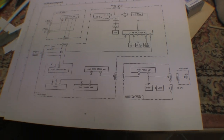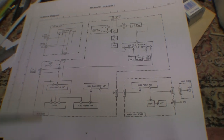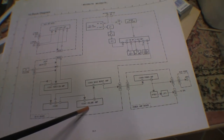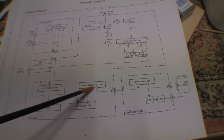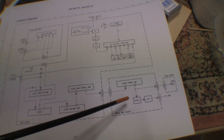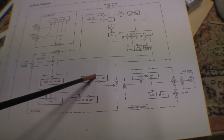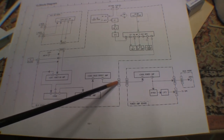Okay, a bit of a wrap-up on this stereo. I think it's fixed. Looking at the block diagram of the whole setup: since the problem is the volume suddenly jumping to 100 percent, I figured the fault has to be before the power amp — because if the signal didn't suddenly arrive at a high level, it wouldn't get out at a high level. So I concentrated on these two ICs and the interconnect, and re-soldered all the pins on both of them as well as the connector.